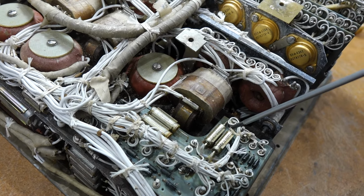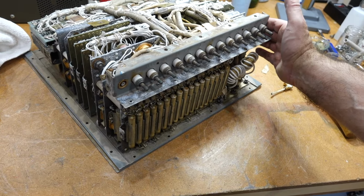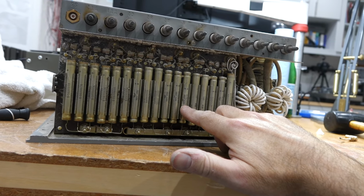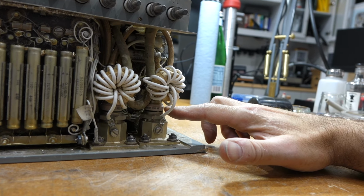We would have a lot of capacitors to check. Plenty. 100 micro. Lots of caps on the side. Oh, that's an SCR. That is the main inverter. Lots of transformers, of course. There's a huge one in the middle. Underneath here, I think that's a big transformer. Some more out here. A bit of a scary monster, that is.